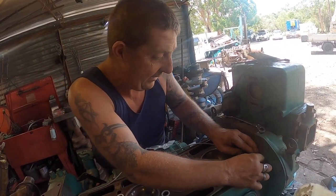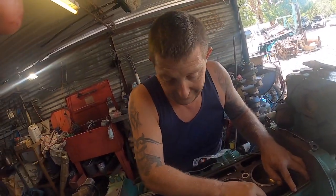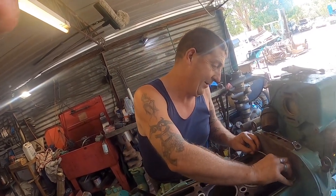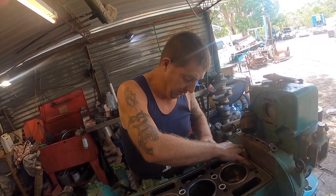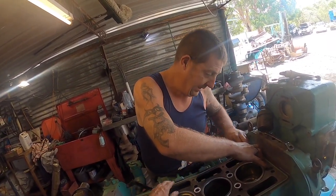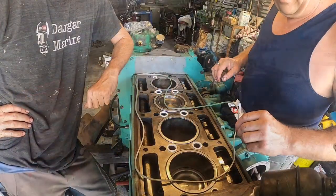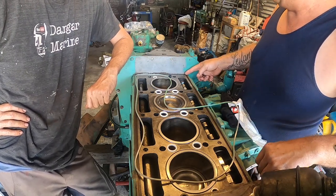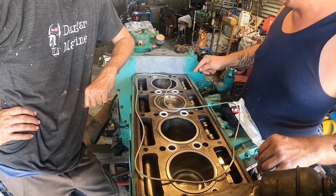They're not a reusable seal either. They compress away and they stay compressed and don't bounce back. So they are designed as a throwaway item. And so this was just a head seal top kit. Some people will actually put matchsticks in the corner to help jam it. It's an old trick, to get the matchstick in there to help jam it in the corner and hold it tight so it won't pop out.